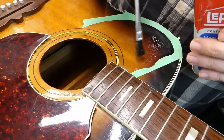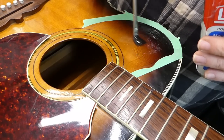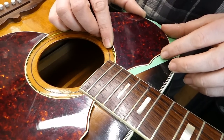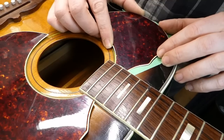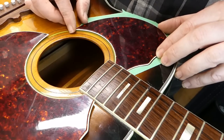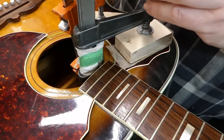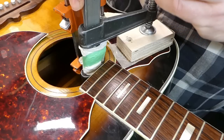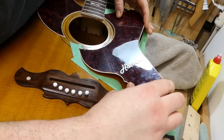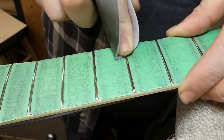I've got to stick these guards back on, and really the only thing I've had success with on these thick multi-ply slightly warped guards is the same thing they used the first time around — contact cement. It's nasty stuff but it works; it'll stay on for another 35 or 40 years. I'm putting it on both surfaces to bond, but trying to keep it a couple of millimeters from the edge because if it squeezes out onto the visible surface it's super hard to clean off. It'll pull off in long rubbery strings, but no solvent will clean it without damaging the surface. As soon as the two surfaces touch they're bonded — there's no repositioning. That's why I have a taped margin around the whole thing so I know exactly where to put it.